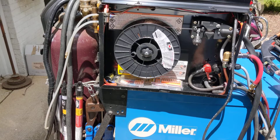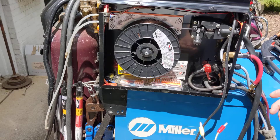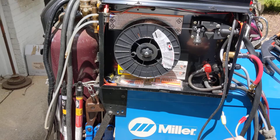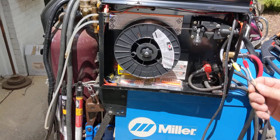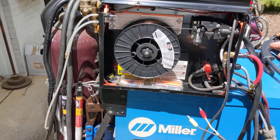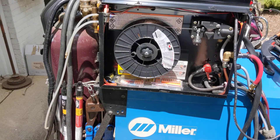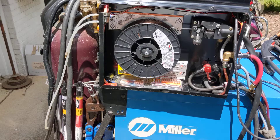So that's the conversion. I also wanted more precision in adjusting the drive motor for the aluminum spool, so I route it out to a variable DC power supply for very precise speed control to fine-tune the weld. Welding with the aluminum spool gun is a little peculiar — it only likes certain settings for certain thicknesses, and I find it easier to use the spool gun rather than traditional MIG for aluminum.